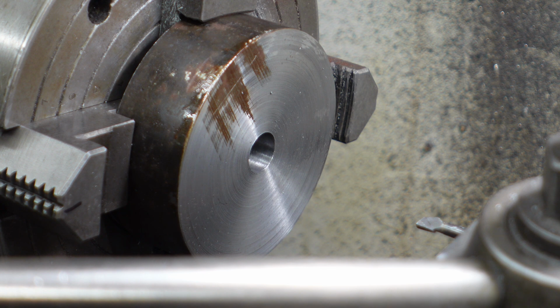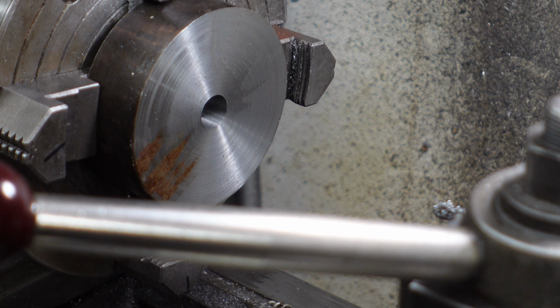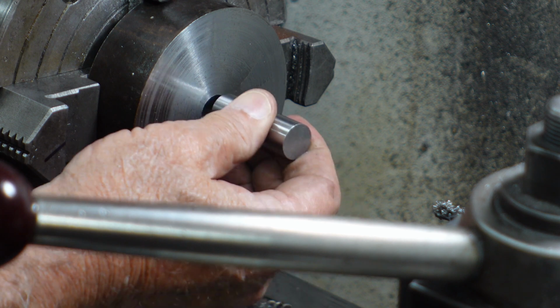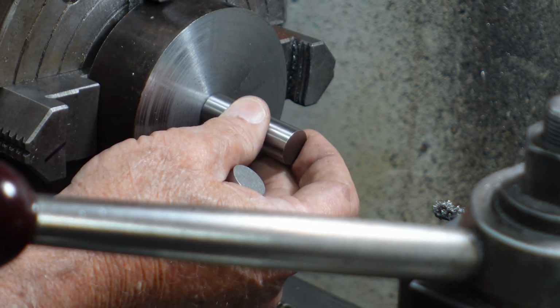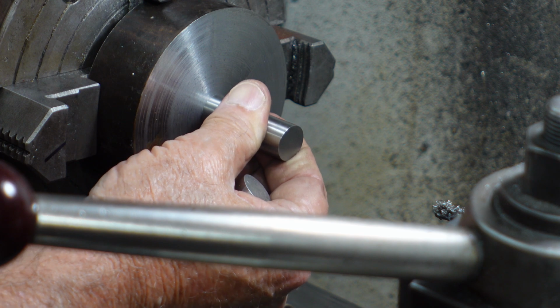I made one pass with the boring bar, and my bore right now, using a gauge pin, is 693 and my target is 703, so I'm going to go ahead and take out 7 thou and check it again, and then we'll hit it for the final number. Well, we should be hitting 699. 699 or 700? There's 700. 700 will almost try to start. And 699 is in.